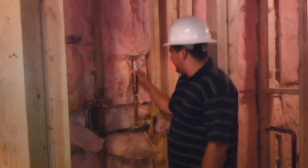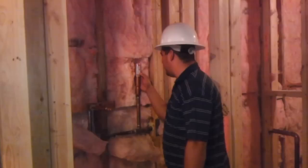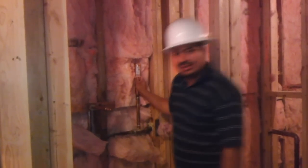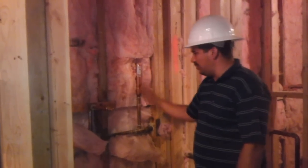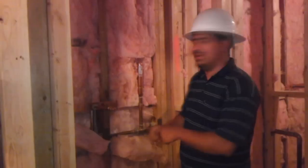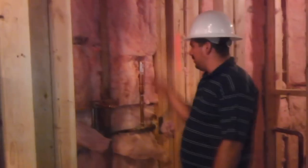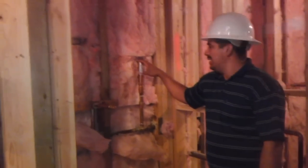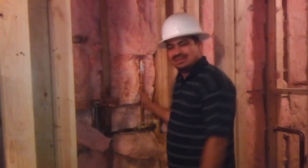As you can see over here, these manufactured items have a certain percentage of working pressure. So as I was saying, they have to be installed according to how many devices and the size of the pipe that are going to be installed, and that will help you determine the size of the water hammer arrestor. You also want to check the installation specs.